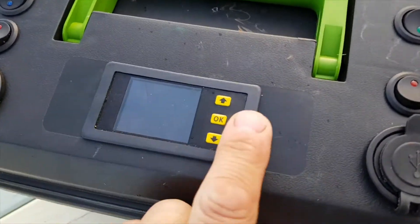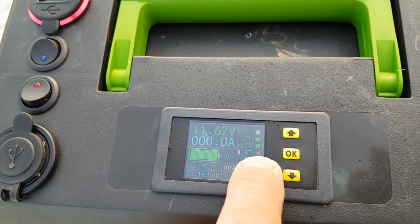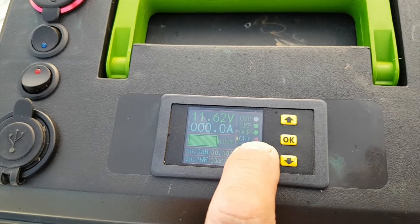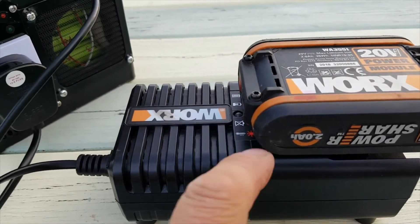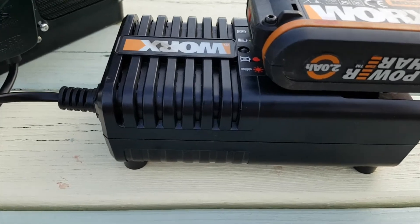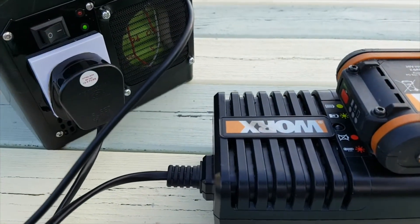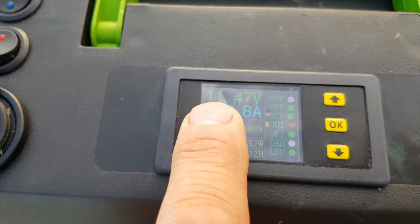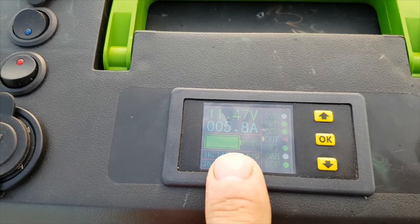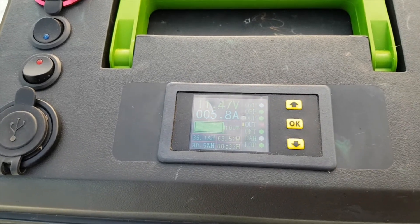To make this work you just press the OK button and when the light goes red it means power is on and going out of the batteries. I've got a works charger — it's the only thing I can grab that's suitable current for this — it pulls about 50 watts. Switch that on — it's obviously on a PWM and it's charging quite happily. The meter is showing 5.8 amps and we're running battery voltage at 11.4. It's showing 100% charge — it's either not calibrated quite right or it needs to be cycled a few times before it works out the battery charge rate.